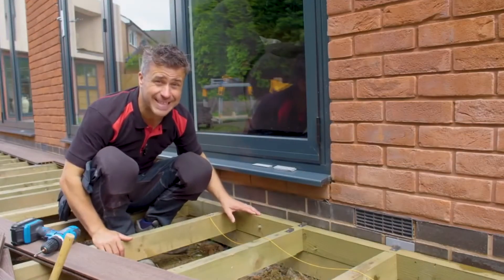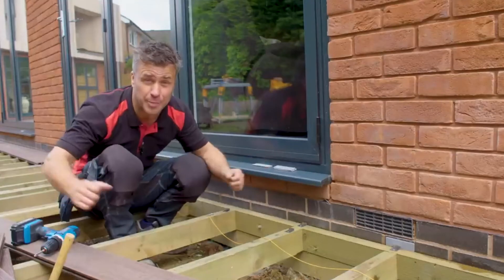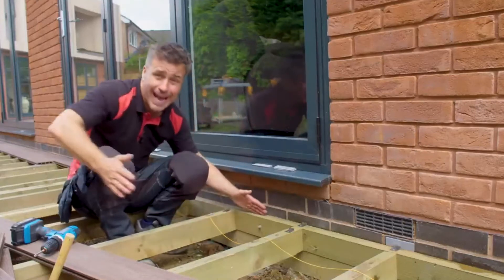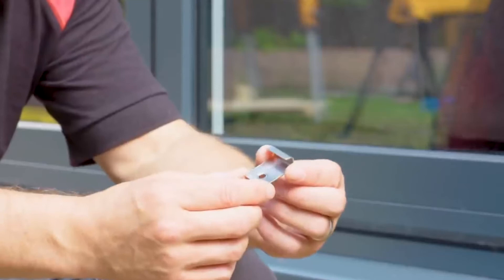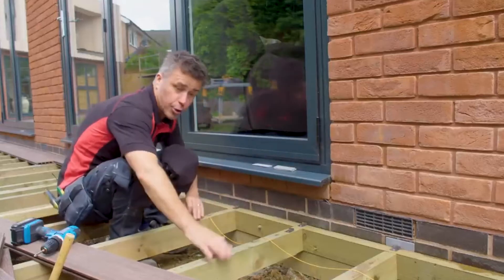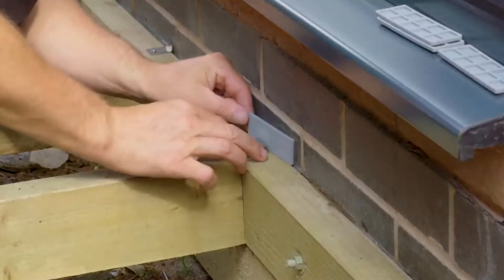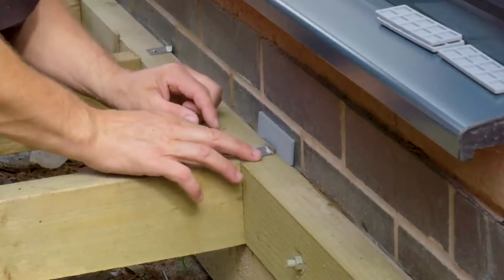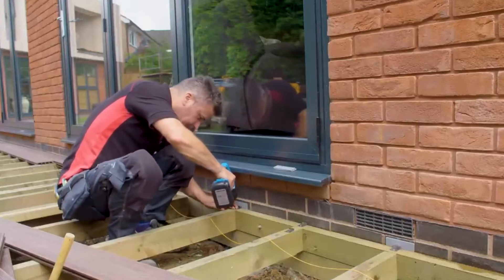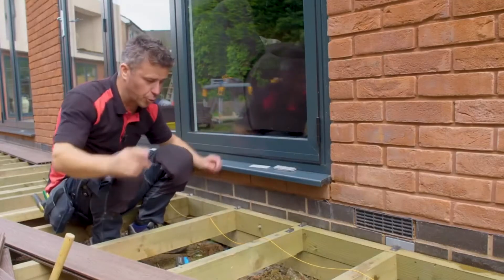Now the frame is complete, you're ready to start fitting the planks. It's very important how you fit the first plank because that dictates where the rest of the planks are going to be fitted. I would always recommend starting up against the house wall or the garden wall and working your way out with the planks. You start off with a starter clip — just like this, it's stainless steel. These are fitted at 350 millimetres apart, the width of your joists. I'm going to put a small packer about four to six millimetres away from the wall to give me that little expansion gap. Screw them down with the stainless steel clips and screws, taking the packer out of course.